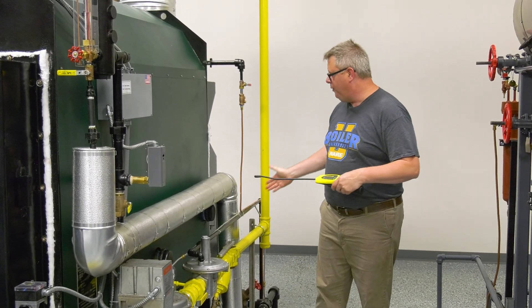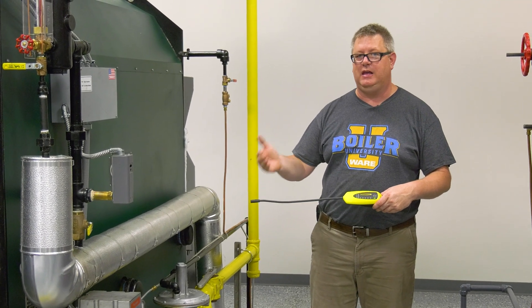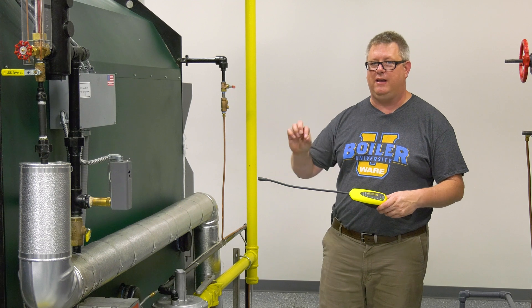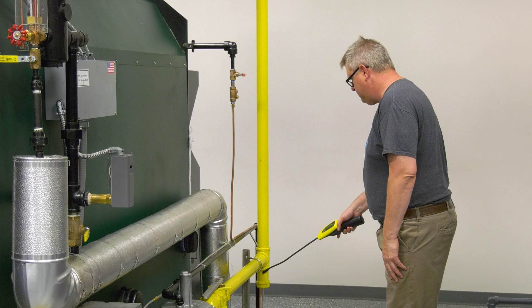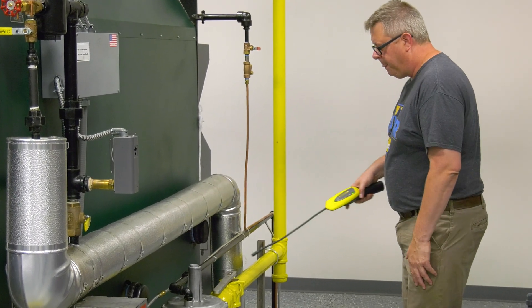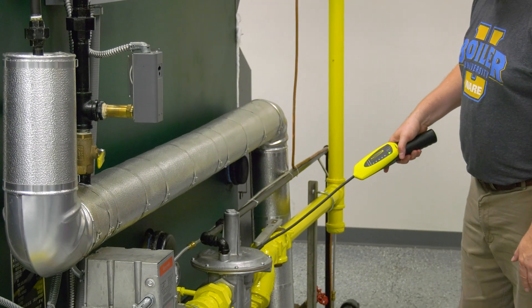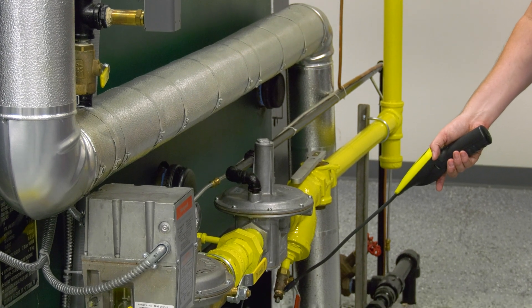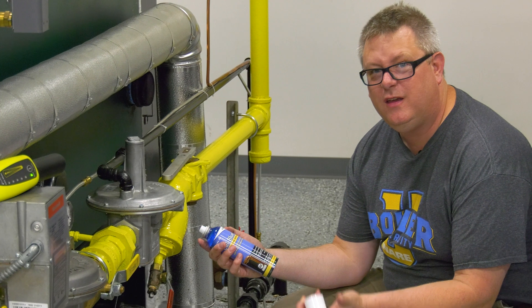If we try to calibrate this in a boiler room and there's a gas leak present, it could give us an error in our calibration and it's not going to be reliable or safe. Generally with our leak tester, we're going to sniff any point on the gas train where there's a joint. These are typically really sensitive, so they may pick up a leak. If it does, we'll usually follow up with a soap check, which I'll demonstrate as well. If I have a leak, the beep frequency is going to accelerate, but you'll want to look at the instruction manual on any tester that you have to verify its mode of operation.